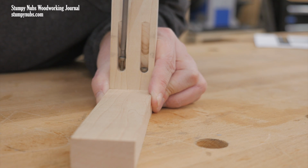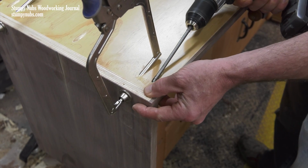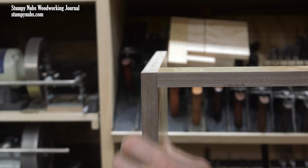Now technically, you may be able to use any screw in a pocket hole. So why do most manufacturers of pocket hole cutters recommend specific screws? Because screws that are specifically designed for pocket hole joinery have certain features that can help you better align your workpieces, avoid splits, and increase the overall strength of your joint.